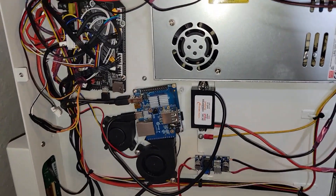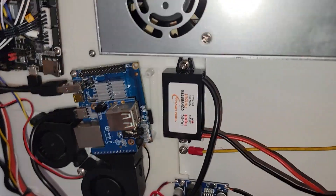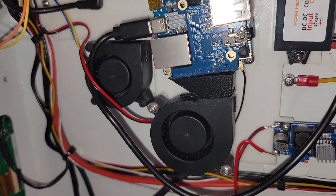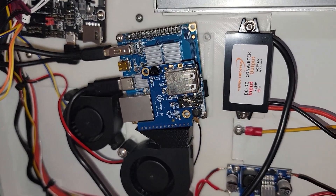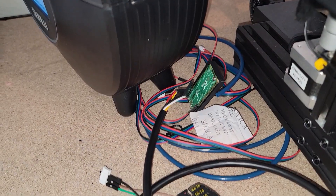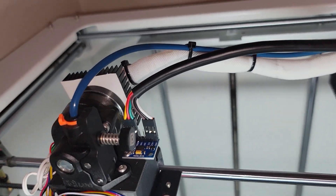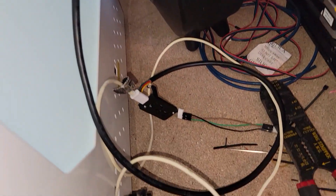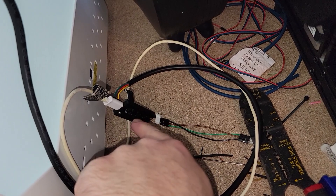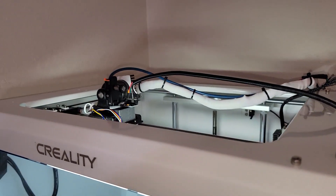This is where your setup will differ from mine unless you're using the same exact thing. Just figure out what size Bowden tube you'll need and run it along the cable and then pop it in over here. If you have a Pro H, you're probably wondering if this clears the top cover — and I'm happy to report it does. I have it running down the back through the stock hole. I'm going to leave the old extruder on there for now just because I've got orders to print. I'm using an Orange Pi Zero 2 running Klipper, and since I don't have an extra USB port, I'm using a little USB extension board.